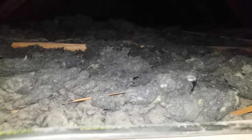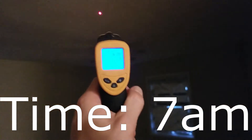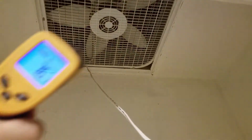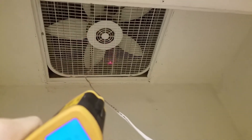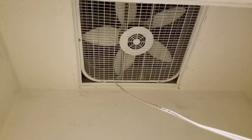I'll update again tomorrow with more temperature readings in the morning. This is the morning after applying the coating to about 60% of the roof. I've reached a low of about 74 degrees all around the house with fans running all morning, taking in outside air at about 68 degrees. One additional variable I changed: a normal 20-inch box fan fits perfectly in the attic access, and I've been running it all night. This has made a drastic difference — it pulls the hotter, less dense air from the ceiling and exhausts it out, while also pushing out hot attic air up to the roof vents.